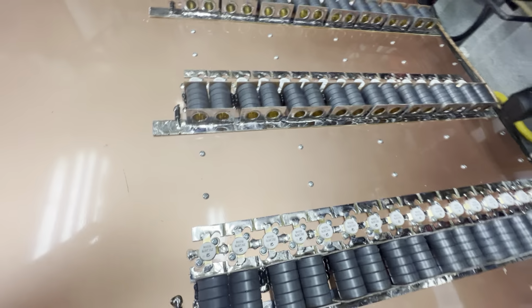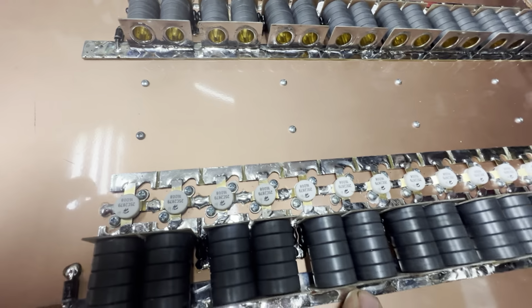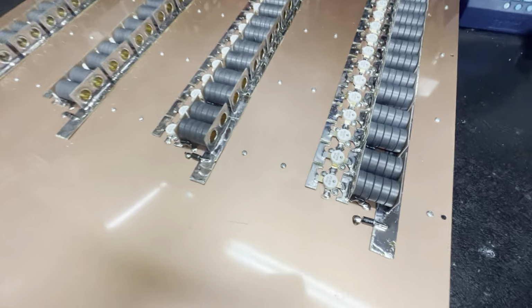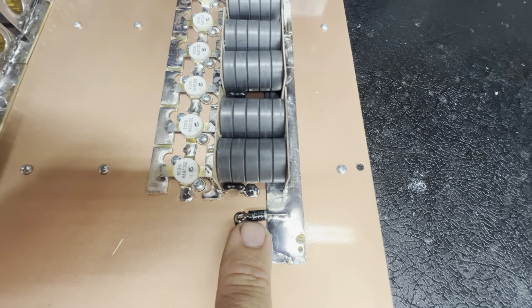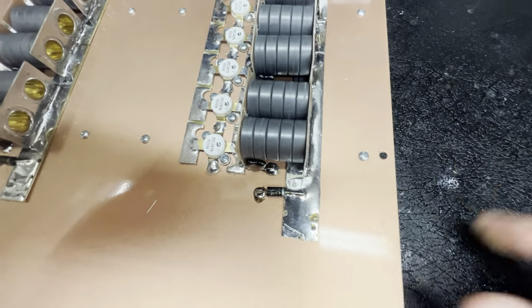Like I told you, the reason I put them under there is one, the foot of the transformer is not touching the ground. Two, you don't have to use a ferrite. It's just a lot easier. And I like it. I think it's nicer. That's my own opinion. Everybody's got their own way. Then this diode right here, like I told you, I know you've seen that it ain't supposed to be in there or whatever. This just tells me if this is blown, this top strip's been grounded out for some reason. So I got one on each one. If anything was blown, I know something grounded it out. That's just pretty much what it is.